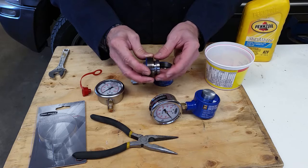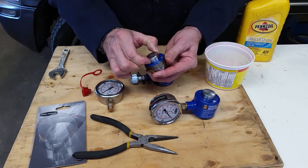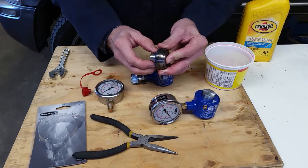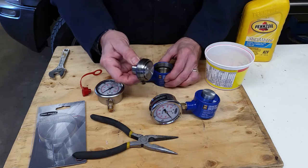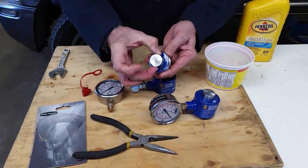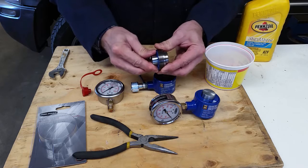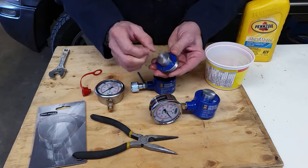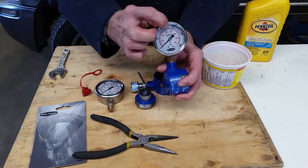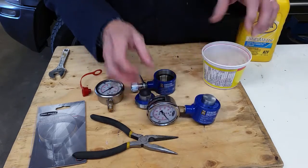Because it doesn't have an o-ring there, fluid can get from one side to the other. So what you have to measure is the actual diameter of the ram itself, because this is going to be the only thing you can use in your calculation. If you buy one exactly like this, you won't even have to take it apart — I'll give you the measurements. The actual measurement is exactly 1.1 inches. So if you work it out, the actual surface area being pressed upon inside by the hydraulic fluid is 0.95 square inches. So whatever your reading is on your gauge in PSI, you multiply by 0.95 and that gives it to you in pounds. That makes it really, really easy.